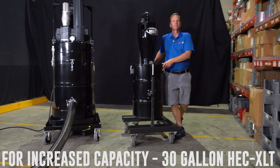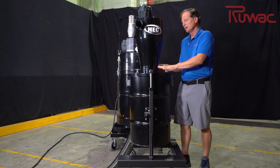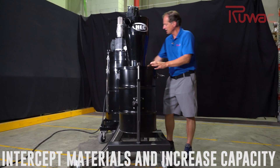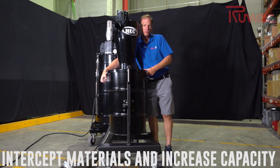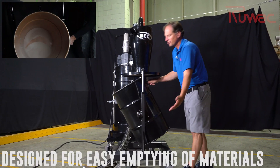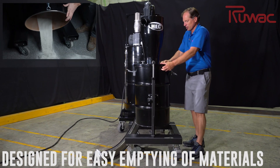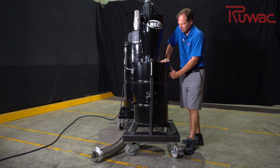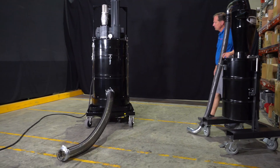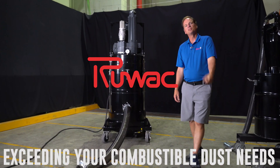Should you need to increase the capacity, Ruvox's Signature HEC series is a very efficient HEC — it's a cyclone that fits over a 30-gallon drum. It allows you to put a plastic bag in here. You connect it to the inlet and connect this to your tubing. Now you would have a cyclone system that can collect more material, and when you need to empty it, no heavy lifting required — very ergonomic. That's how you could pair additional capacity to your PR series. This has been a short review of Ruvox's new addition to the Class 2 Div 2: the PR series, designed for many central systems to meet your combustible dust needs.